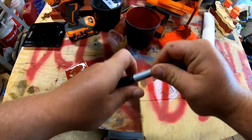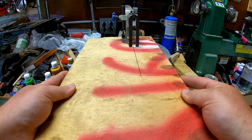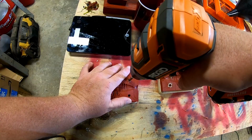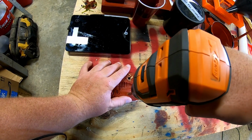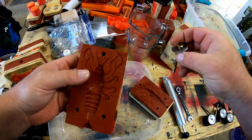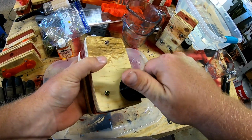I put on the sides, the wooden plank sides. So all I'm doing here is cutting out some 1/2 inch or 3/4 inch plywood, depending on what you have. I'm running the bolts through the areas where we had our spacers in the mold themselves, putting the bracket on to hold the bolts in, and then I've just 3D printed some knobs that'll hold it on. So after that, we're just going to shoot it.